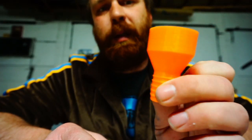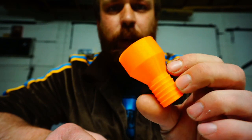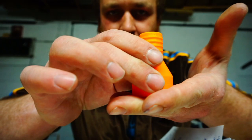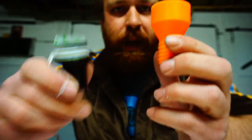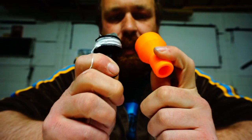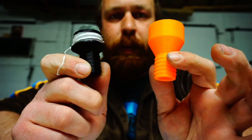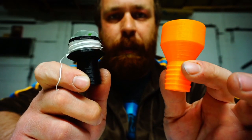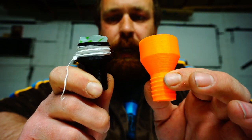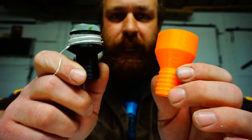I designed this to be printed as fast as possible with no trimming or any handwork afterwards. This has a look that just would not print very nicely on the bed, but it prints just fine like this. What's important here is speed and cheapness. These are printed with three shell layers on the top, the bottom, and the walls, at 10% infill. You don't need any support material — this one on the bed like this, this one on the bed like this.